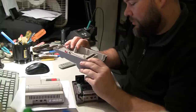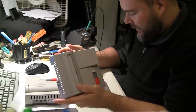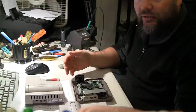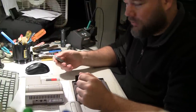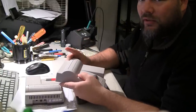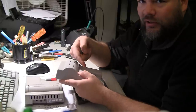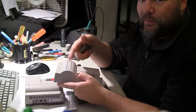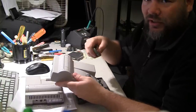Not really much to show with the spring. After that, I think it's just going to go back together and go back to the customer with the new CPU, PPU, and SRAM chips. That was definitely an easy fix — not worth showing. You can see it comes all the way back up now. That was just the prong that comes back and touches the front part — it was bent. I just bent it back and now it works fine. So let's go into the hot air thing.